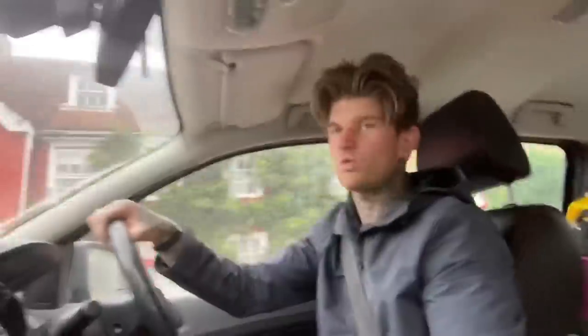The only thing I really had to show today, little tip, was the working out of a bucket with your first course, setting out, with a little tile setter trowel, Marshalltown tile setter trowel. It's just nice dragging a bucket around with you, because you're forever moving around with boards and that, and you never get your board where you want. You're best just dragging a bucket around with yourself and just a small trowel.